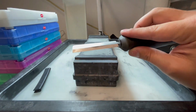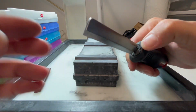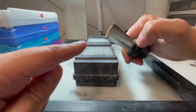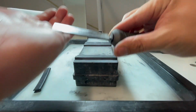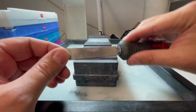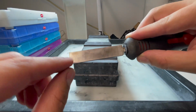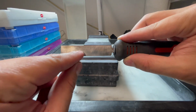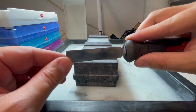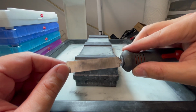And as you sharpen for a right-handed scraper, as you try to take steel off this side, the blade will curl over so you can take material off, kind of like a shovel. You're kind of making a hook out there. And the problem this knife is running into is the scratch pattern on this side, that long flat side. You can see in the camera this slightly lighter or rougher part. And what's happening is that spot right there is not getting sharpened.